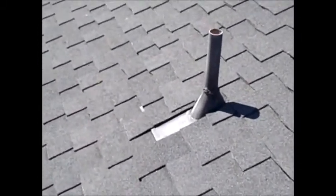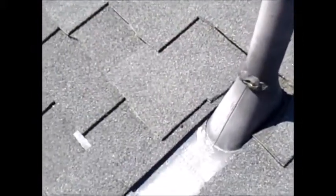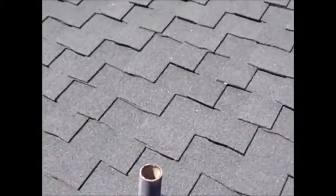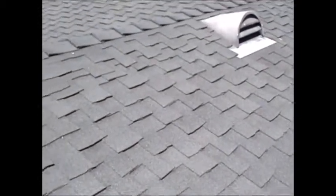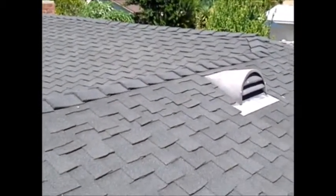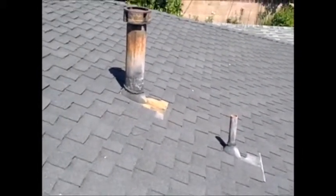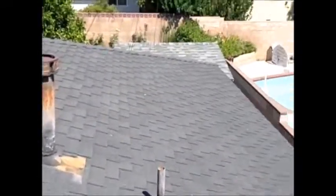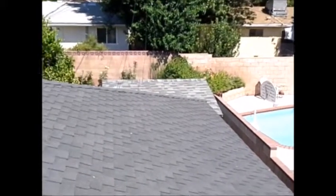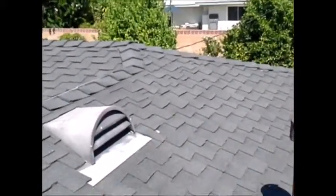It's a one-layer roofing, and these other vents here, these are plumbing vents, and they're flashed properly. And you got some half dome vents for your top of your attic, and most likely have some gable vents. So that's what you have here, and no gutters on the side, and always a good recommendation. And if more people do that, it'd probably rain more too. And I haven't been inside the house yet, so I may add a little bit to this.